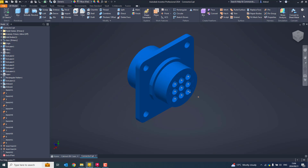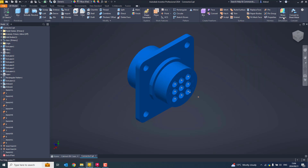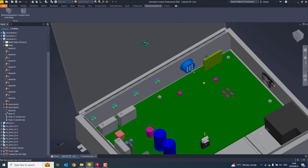Now, if you want to know how to put the pin number in, make sure that under your Show Panels, you've got the harness panel ticked and it'll come up over here. Select pin, click where you want it to be, and there's your pin number — number 10. Let's close this down and go back to the assembly.